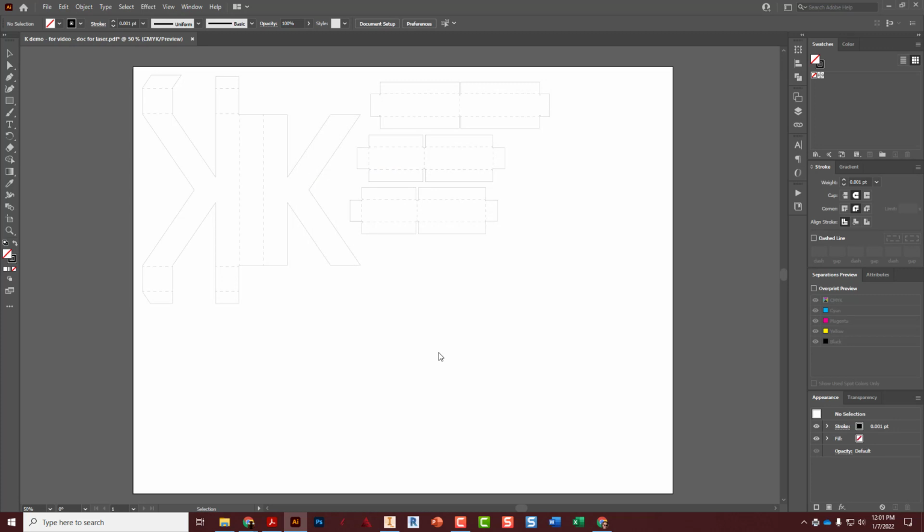And that sends the job to the laser, and at this point you get up, walk over to the shop, you load the laser with some tag board or rotate it so you have a clean area to engrave out of. Find your job on the list of the display. Use the joystick to go up or down and find your job, which will be your file name. So remember that. And we press the go button to have it do the work.